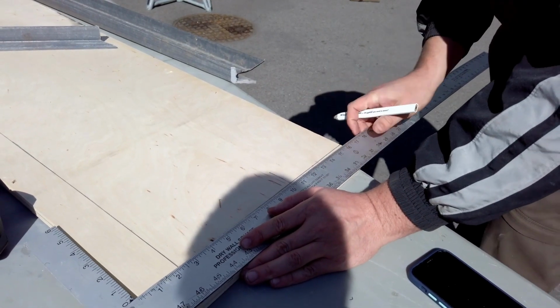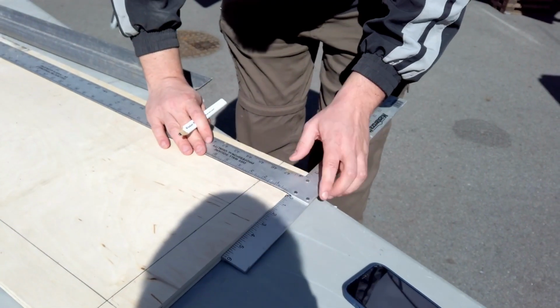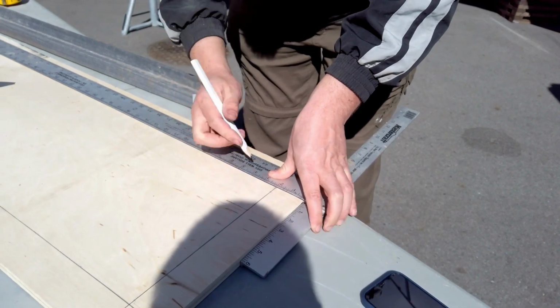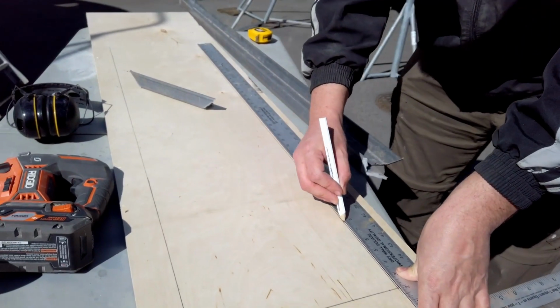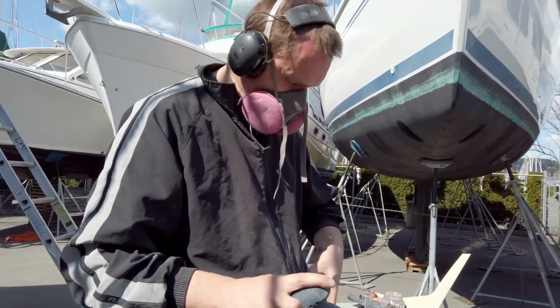So our thought being, we got this glass from an automotive company, we would always be able to do something like that. Always replace a piece of glass. It might be easier to replace than acrylic. We also wanted to avoid the crazing that acrylic can get, and so overall we decided that tempered laminated glass was the way to go, but it was not without its challenges.